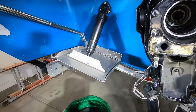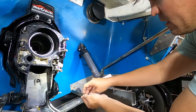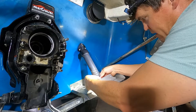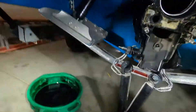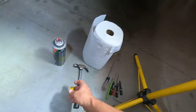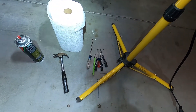I finished that first one already - that one was a pain in the butt, but I learned a couple things, so hopefully this one goes smoother. Take the hose clamp and start it around the piston shaft that comes out the bottom. Things you're going to want: a drain pan, hose clamp, probably a roll of paper towels, some brake cleaner to help clean up, a hammer, something to help push the piston in - I'm using a seal driver here out of my seal driver kit - and a couple of picks to get the seals out once we've got the piston apart.